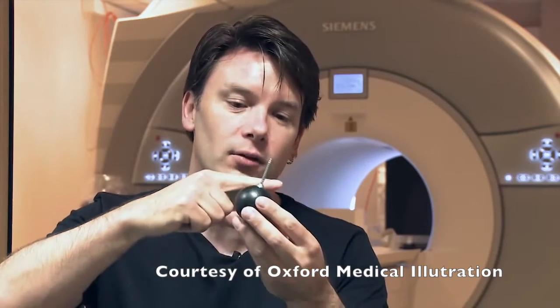But the problem is that we can't see this tiny magnetic field because it's being swamped by the huge magnetic field we're creating with the scanner. It's kind of like trying to see a candle in front of a spotlight — the small light is just completely overwhelmed by the large light. But what we can do is apply a second magnetic field which is perpendicular to the main field; the proton is going to want to precess around that as well, but if we apply a very small field it's going to precess quite slowly.